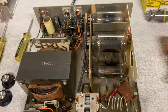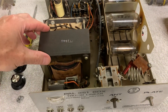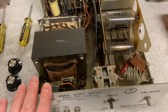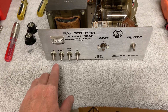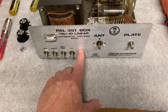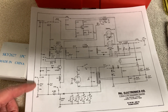It won't be too difficult. This should be a pretty simple project. I just got to take everything out of there, replace what I can, modify where I can on it. By the way, this was the earlier version of the 351. The last few models they made, they drilled one more hole right here for the AM and SSB switch. This schematic is the later version of it. This amplifier did not have that switch — these two other components were basically not there. They just had a delay in there.